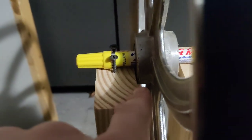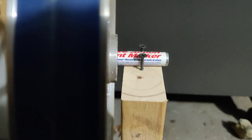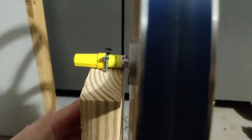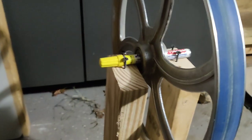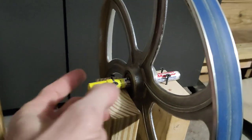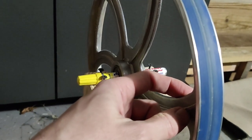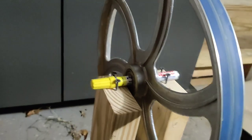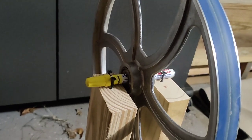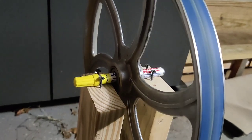You want to make sure there's a little gap there — you can go a little bit more — and make sure there's a gap here as well, which there is. Now the wheel is sitting on what we'll call a rod, and the wheel is supposed to be balanced. But if you put the wheel right here and let it go, it wants to go backwards — even if you kind of swing it just a little bit it'll actually go back. That's what we're going to use to gauge and figure out how to balance it.